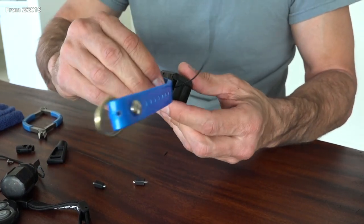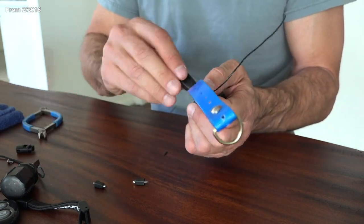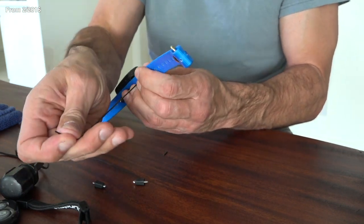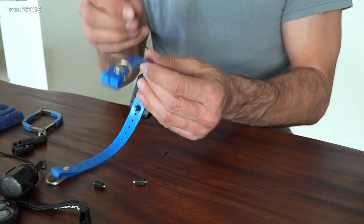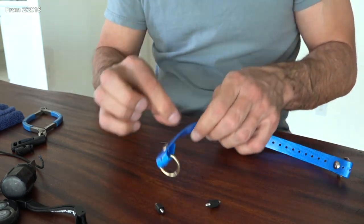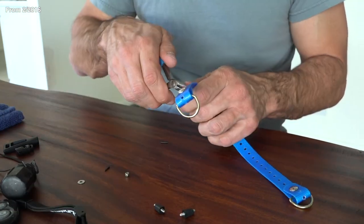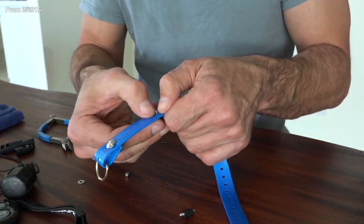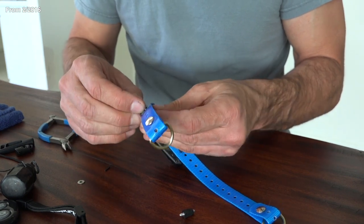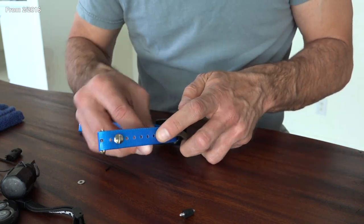Also remember that the direction you turn the prong in should be the direction that the wire is in underneath the prong. And now what I like to do, just for aesthetic sakes, is weave this through. And now here, I'm going to strip the wire again. You're now going to need a lock nut. Bend this wire. The screw comes in from the back, and then the wire is right on top of the screw, like this. Take your lock nut, and the lock nut's going to make it easier so you don't have to keep tightening it every time, and simply tighten it down.